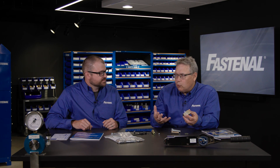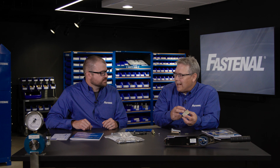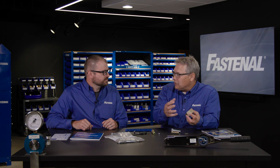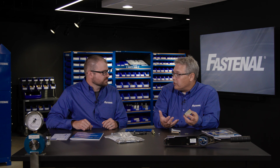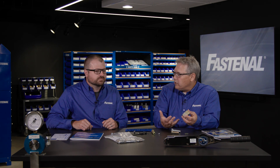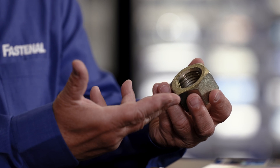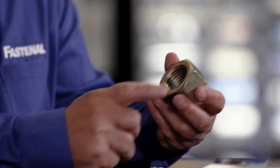On the various grades you'll see out there, there could be dots or dimples on flanges. The number of dots, dimples, or lines and their location will tell you the type of grade you're looking at. You could also have a number — a 2H, for example — stamped right on the nut.